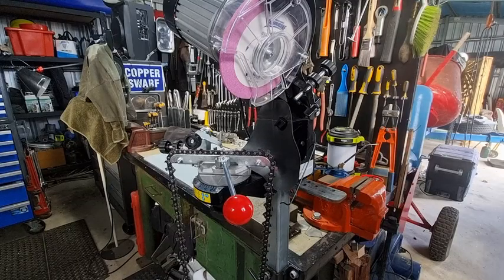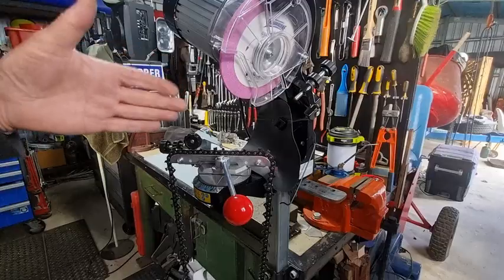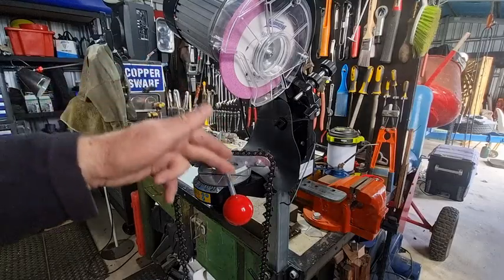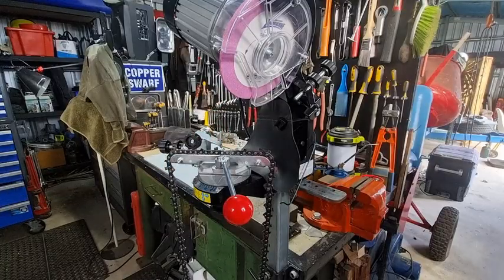It's not an issue if the backstop isn't touching the wheel, but it's certainly an issue if you swap left to right and it's touching too much on the wheel — it'll start to grind off more. You're in control of the grinder; the grinder is not an automatic thing. You set how much it grinds off — the grinder doesn't set that. So if you've got a mistake, it's because you made the mistake. I hope that information helps, because I know — and I've done it myself when I first started using grinders — I found out I was grinding too much on one side because I was switching the movable vice from left to right without readjusting. That's the mistake a lot of people make. Thanks for watching, bye for now.